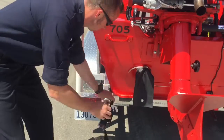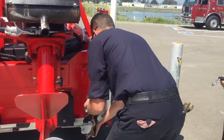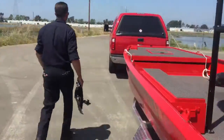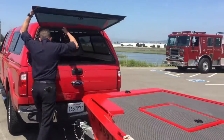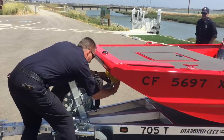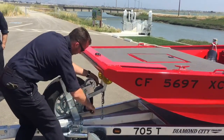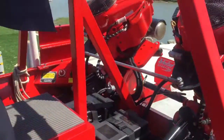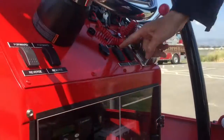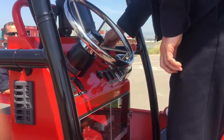Come around, remove the rear straps, and place them in the back of the truck. Undo the front winch on the boat and the chain. Turn both battery switches to the on position, place both trims to the highest position, and start both engines.